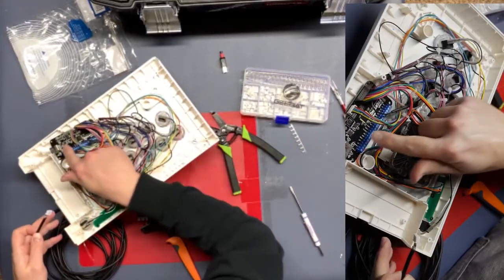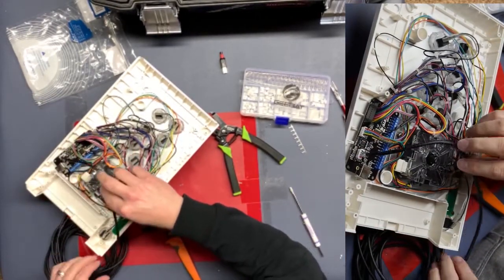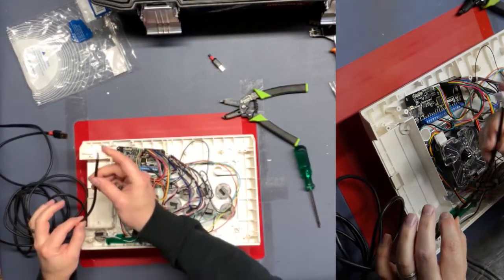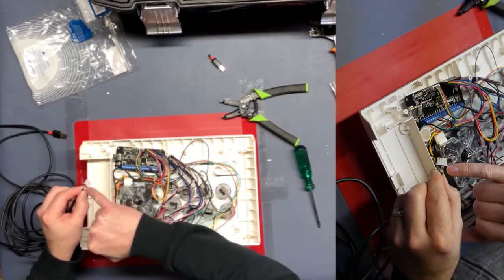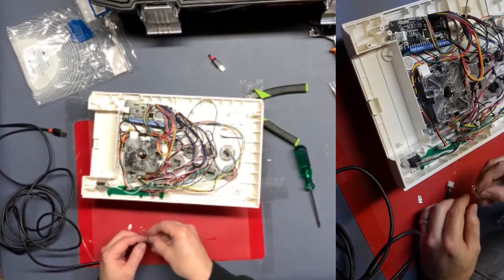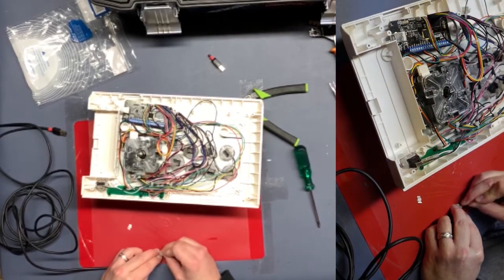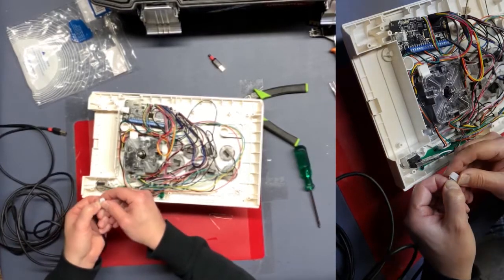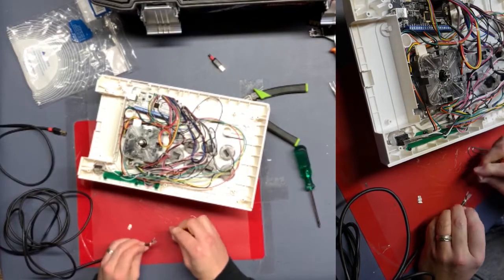Now on the board I just have to make sure that the red one's in the right spot. But wait — what if we got these all in perfect and forgot a step? We wanted to put something on the cable before we put this on — either heat shrink tubing or something similar. Well, these little tabs — you can depress those and they will slide out, the wires will slide out. Then you can pry them back up and push them back in. A paper clip works great for this. Smash these tabs in and they pull right out, as long as you've smashed them down enough.